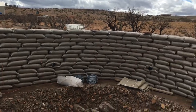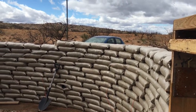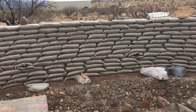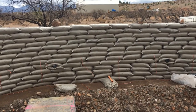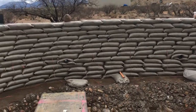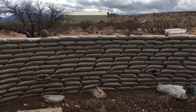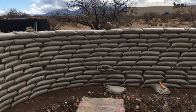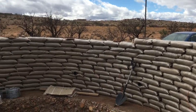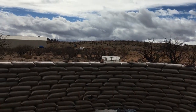They just take a long time, but they do fit together nicely. They have a lot of resistance to earthquakes because of the flexibility of the walls — the walls kind of shake when you move them but the earth bags stay in place. With earth bags you're really not supposed to do too long of walls without putting a buttress on the side to keep it stable. But I'm going to be putting timber posts all the way around the outside of this in strategic locations.